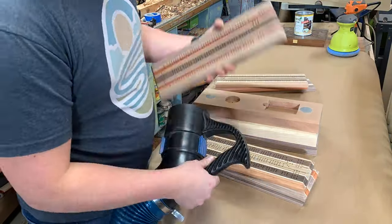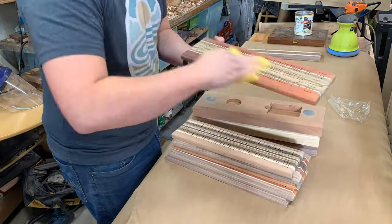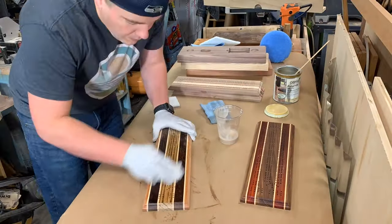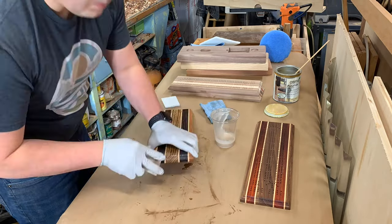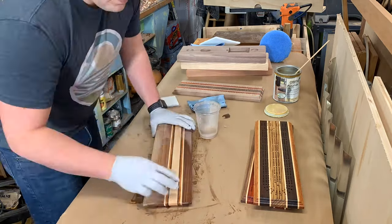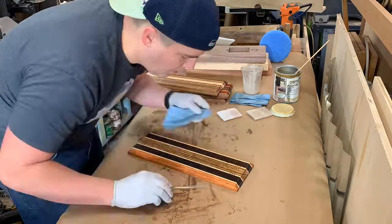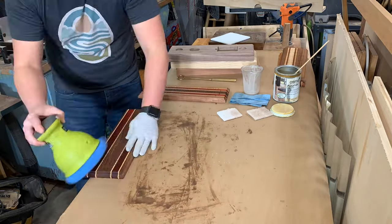Before applying finish, make sure you've got rid of all that dust — use your shop vac or vacuum and be careful not to mar up the surface, then get some tack cloth. Tack cloth is really important especially for film finishes; it really gets all those little dust particles. Then apply your finish and start to see those natural colors come to life — best part by far. I'm using Osmo — you just buff it in. Don't leave any sitting on top; dry it all off afterwards. Also, don't let any hang out in those holes — use a pick to get it all out of the holes, then buff it in.